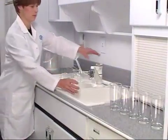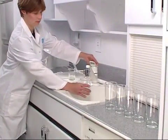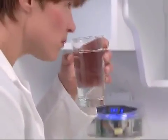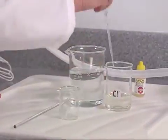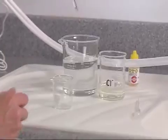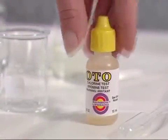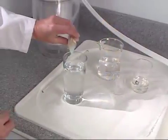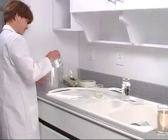City water is often treated with chlorine. While chlorine is not generally a health hazard, it can produce disinfection byproducts and can give tap water an unpleasant odor. For this demonstration, we'll add chlorine bleach to make the odor very evident. OTO, a sensitive chlorine detection chemical, reveals the presence of chlorine with a distinctive yellow color. We'll place this glass aside as our pretest standard for comparison.